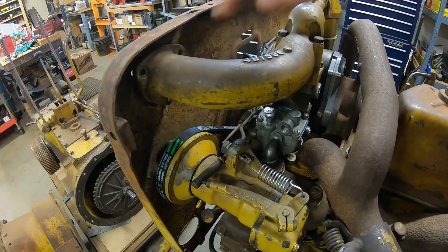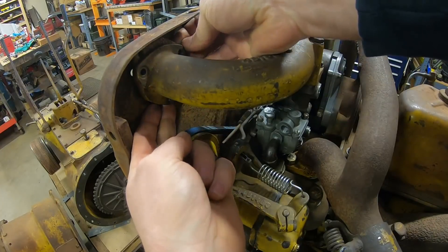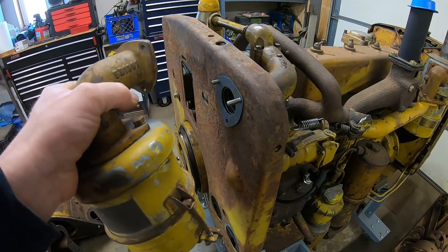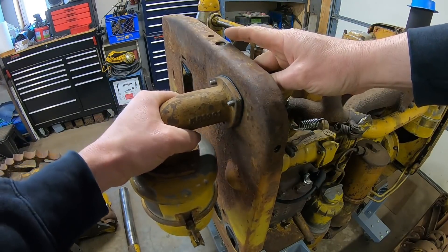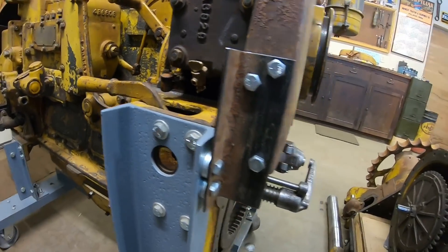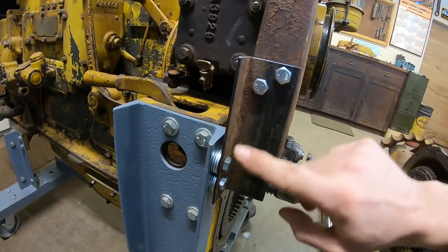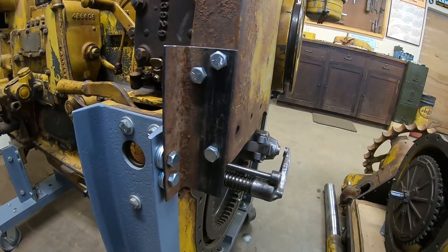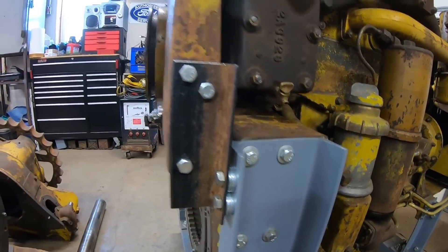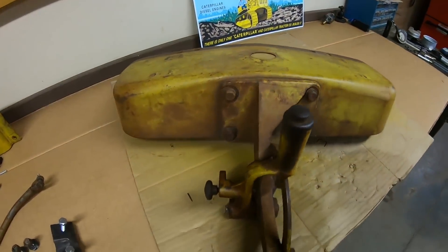The inlet elbow on top of the carburetor actually attaches to the dash panel — there's a hole that feeds through it — so we need a gasket on this side. Another gasket goes on the outside of the dash, and the air cleaner for the starting engine is an oil-bath type, pretty much just like the air cleaner for the diesel. To make the fit-up possible, I had to create brackets for each side of the engine stand, because the side fenders bolt to the bell housing using four bolts and then the three bolts of the dash panel go into each side of the fender. Since we don't have fenders, I replicated the bolt pattern and put a mounting bracket on each side of the stand.